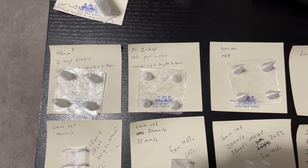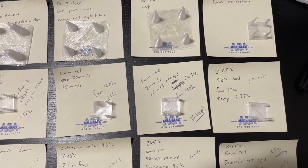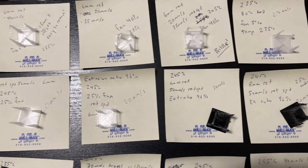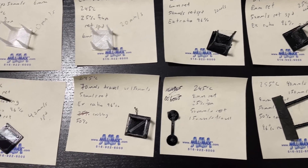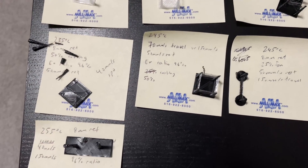While trying different filaments I also tried different settings. I changed temperature from 215 all the way up to 260 — that didn't work. I changed the extrusion ratio from 85% up to about 105% — still got a lot of blobs, and too low an extrusion ratio caused layers to separate. I changed bed temperature from 70 to 90 degrees. I tried print speeds from 20 up to 60 millimeters per second. None of it changed the blobbing.